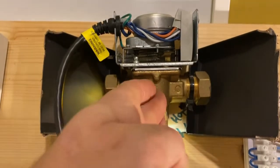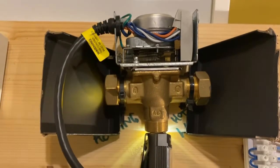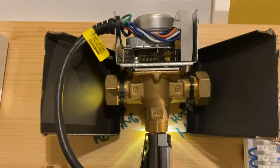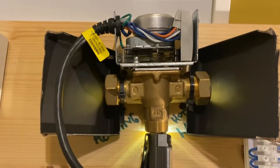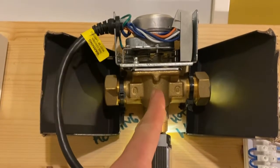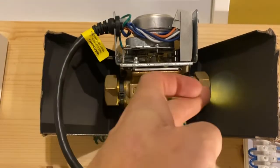As you can see, all the light is now blocked to this side, and we've got light here which tells me this is functioning properly — water is flowing through here. Now if I put a hot water demand on as well, you'll see a bit of light come here and here, because we've now got a heating and hot water demand. Very simple. So let's take our heating demand off, and again that ball will just move over, block this side, and only allow water to flow through there.